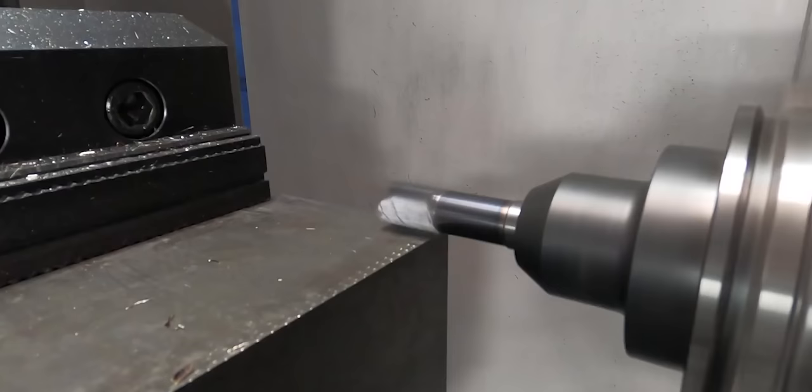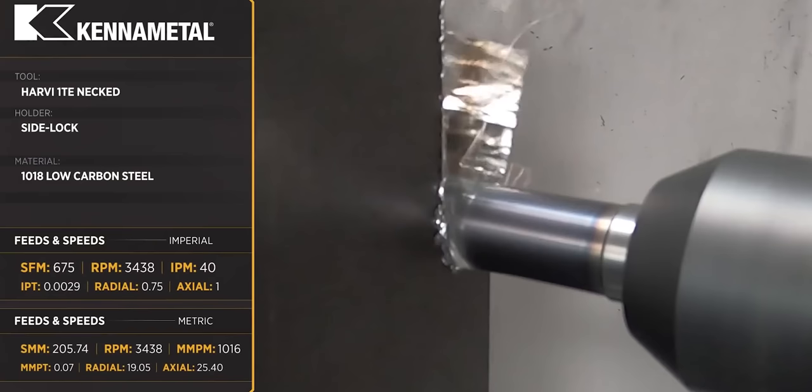One of the things I find really incredible about these end mills is that as the cutting edge chips and breaks down, the tool basically resharpens itself, almost like an arrowhead. With any other end mill I've ever used, once you have chipping on the tool and you're missing corners, the tool is pretty much going to disintegrate immediately.